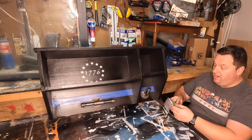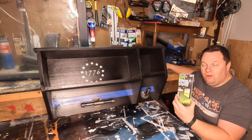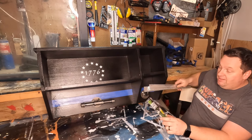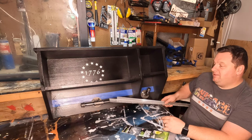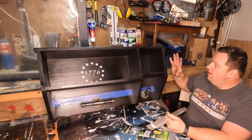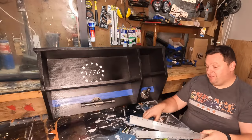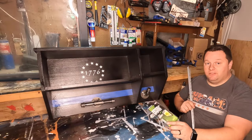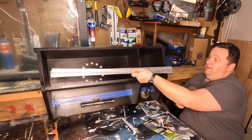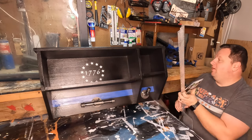How I'm going to hang this — and how I recommend hanging these — is to get these heavy duty mirror and wall hangers, picture hangers. This particular one says it can hold up to 300 pounds. Even if you put your vest up here and your belt on there or whatever you'd put on this thing, plus the weight of the wood, you shouldn't have any issues whatsoever. This one's rated to hold up to 300 pounds and it's almost the entire length of it, so it's going to distribute the weight nicely. I feel like this is a good option for mounting.